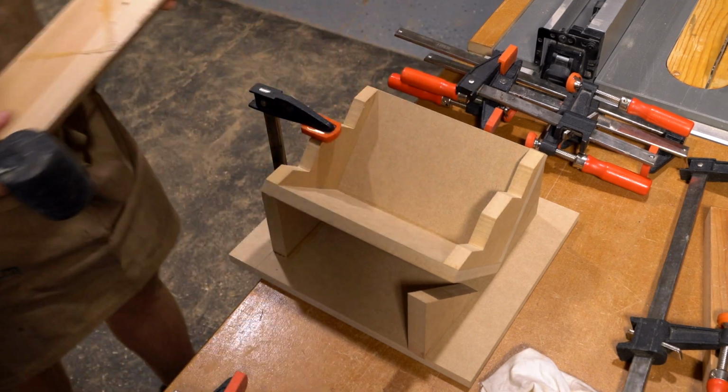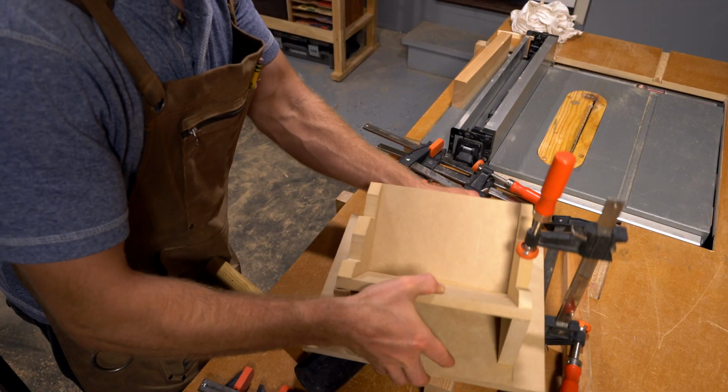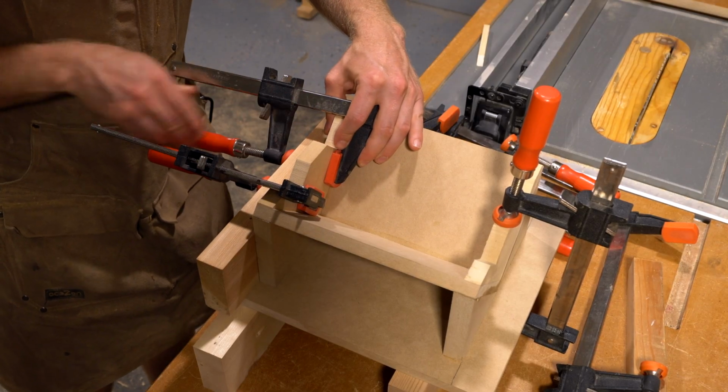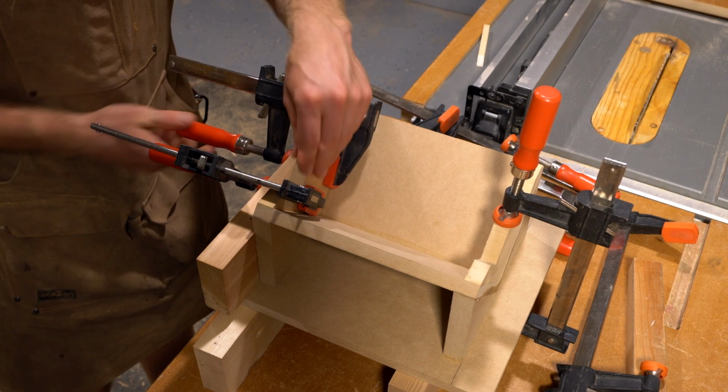To finish the assembly process, I flip the jig so that I can mount the reference board to the other side with clamps. If you feel comfortable tackling both sides all at once, I suppose that would work and make it much faster to assemble. I tend to work on the slower side, so it was easier for me to focus on one side at a time.